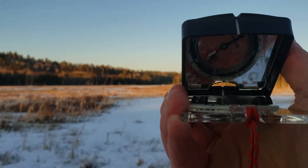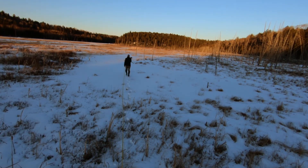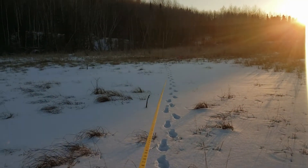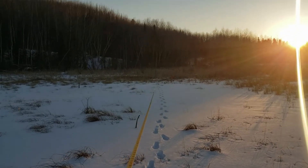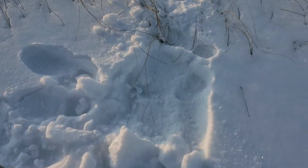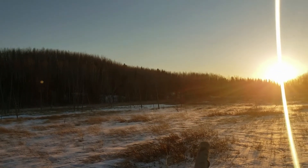I'm going to start out in this direction at sixty degrees. I have a point in the distance that I'm walking to, and I'm dragging the tape measure to measure out a hundred feet at a time. There's the first hundred — pulling along. I'm now going to create a little line right here in the snow so I can see when that tape measure base gets back to that line.